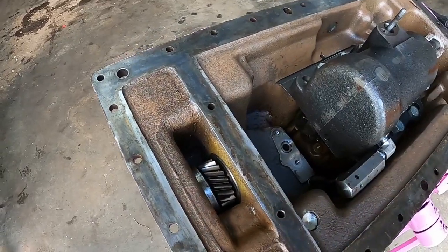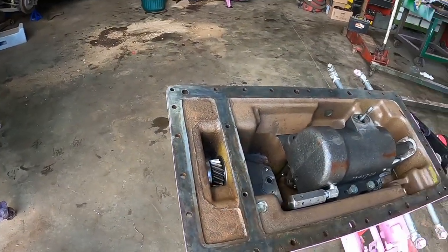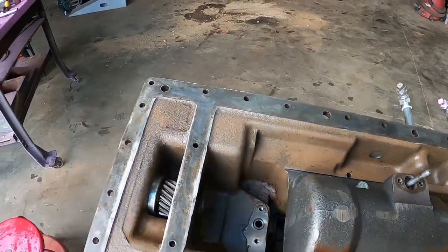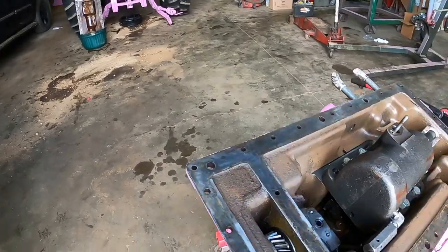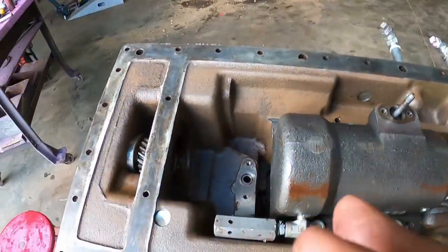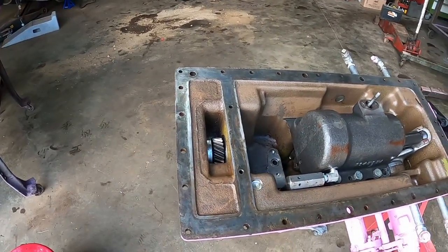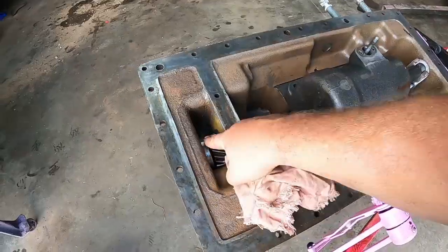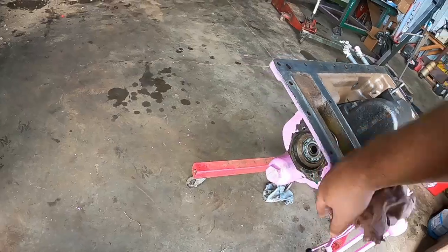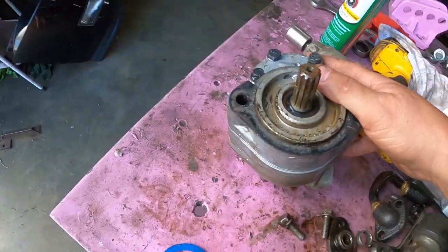That went better than I thought when it first came out — I thought I'd be ordering bearings. I ordered these last fall for the combine; I only needed two but could buy four just as cheap with faster shipping, so I bought four figuring I'd have spares. They were for the pitman arm on the 8570 combine and they were exactly right for this. I'll let that cure before I mount the pump. The pump came with a gasket that's the exact same one for the front — pay dirt.